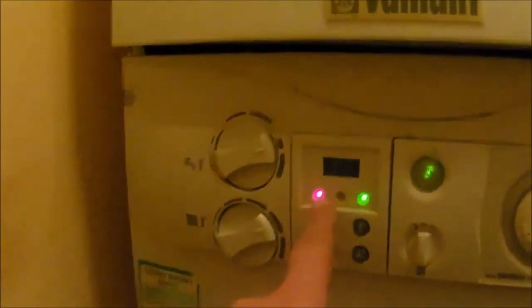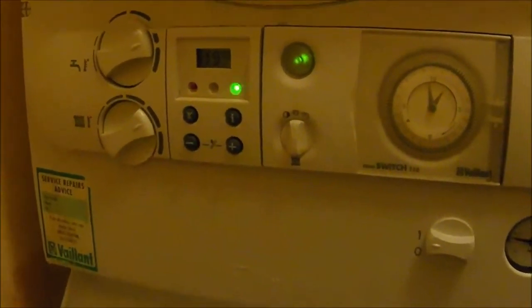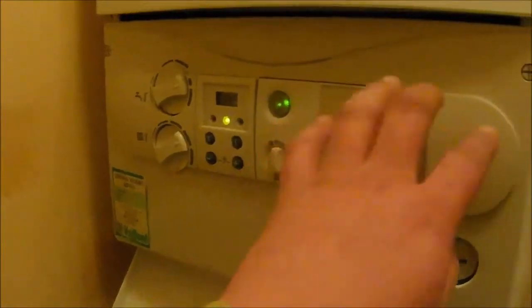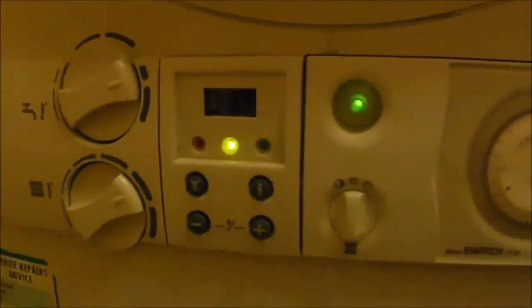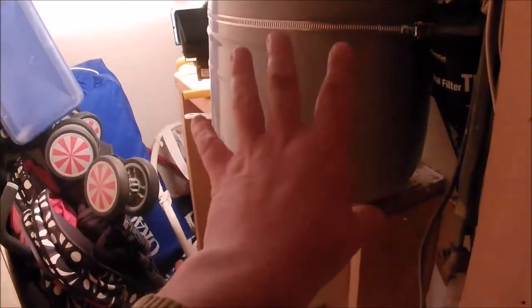Right guys, we're just under a bar and we've got all that water upstairs. Let's switch on the main — it came up as a fault, fault 26, and we'll just fire her up again. Here we go! Now we've got a bit of air still in the system, but the circulating pump's on so it'll fire the water around the system and all the excess air is going to go back up into David's room, but we need to do the circulation first. She'll quieten right down — it's very loud but she'll settle. The temperature's going up really nicely — I think that means it's firing. I tried to get the bracket up in the wall but the raw plugs weren't all that great, so I'm going to put up a piece of plywood to hold this expansion vessel because it'll be fairly heavy now it's got water in it.